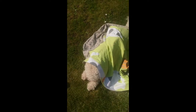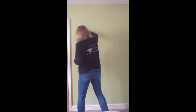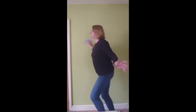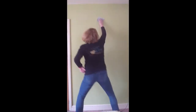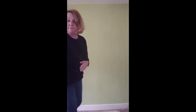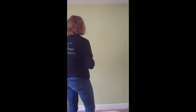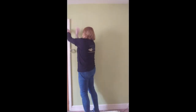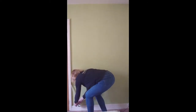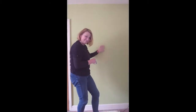Please make sure that you cover up everything in your work area with dust sheets before you start. Then you can start to prepare your wall — it needs a really good sand down, preferably with an electric sander. If you don't have one you can sand it by hand and use that as your workout for the day. Once your wall is lovely and smooth, give it a good wipe over with sugar soap or with a very weak washing up liquid solution. You can then mask up all the architraves, skirting boards, and the ceiling and walls next to the one you want to paint, and you're then ready to go.